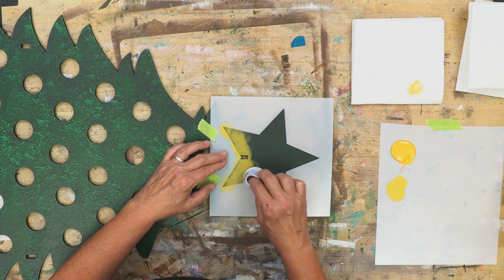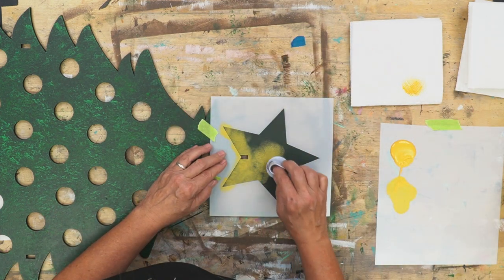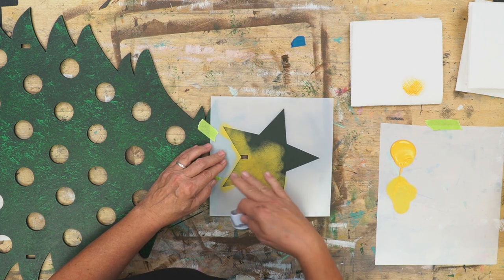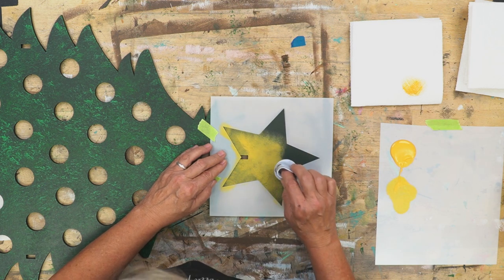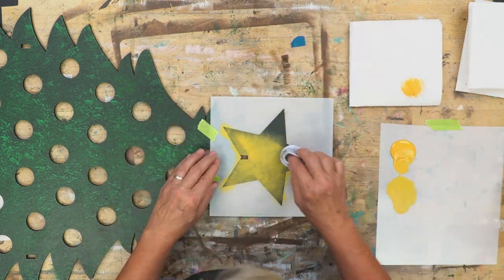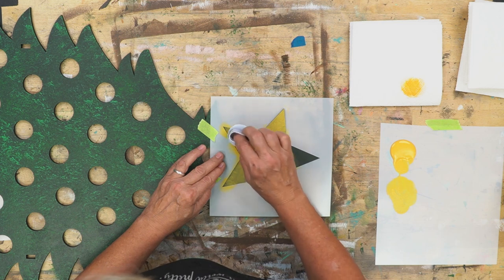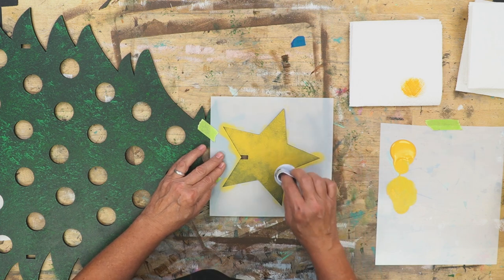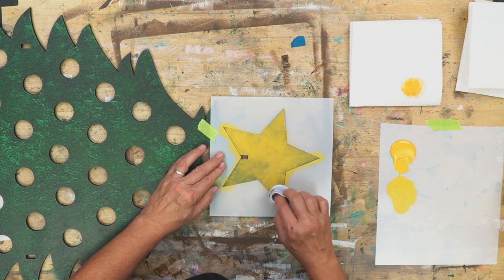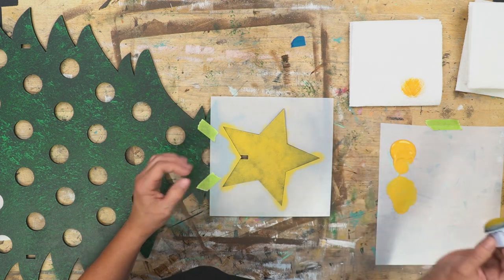This is how I do all large spaces — I either use a roller or a jumbo dauber because it's easier. I'm working from the middle and circling my way out. While it's wet in the middle, that's when it'll feather nicely. So this may not seem like a big deal, but this is a pro tip. We're going to let that get dry with a blow dryer and then give it a second coat.